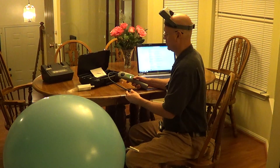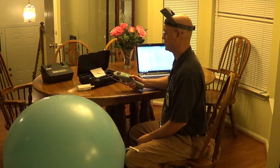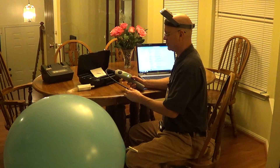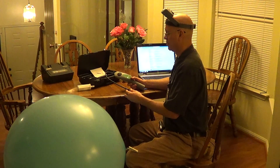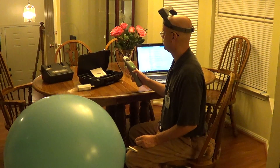Let's see if it will zero out on a reference leak. So that's a lot of zeroing — because when you're talking about 50 parts per billion, you're going to find leaks that are smaller than you would even worry about; you're going to have some background. It seems to re-zero pretty fast: 2,000, 3,000, 4,000, 5,000, 6,000 — basically 6 seconds. Now if I take it away and put it back — that re-zero is pretty fast. It's a nice little leak detector. Too bad it's not more sensitive on R410A, but it is sweet on R22.